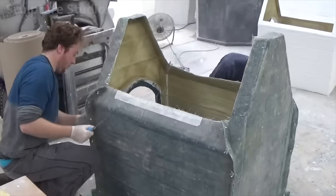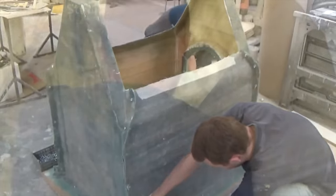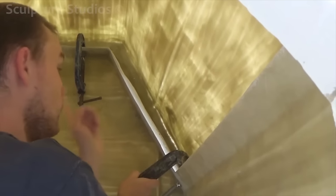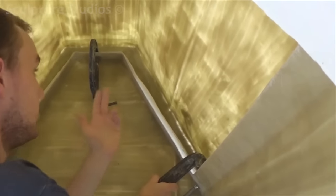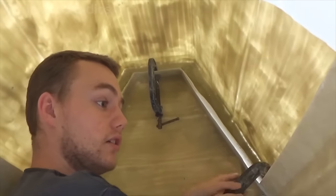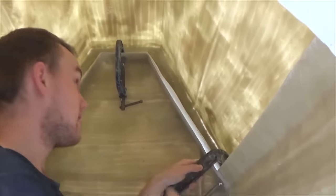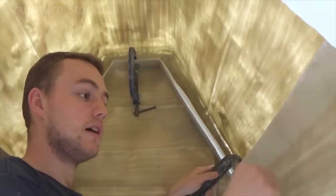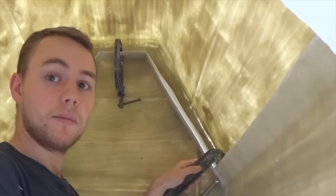When finished, the roofs are put on top of the base sections so they can be fixed together as one unit. Aiden is bolting together the base part and the roof — first matching them up so it's even on both sides, clamping down the tops and then the sides. He drills holes evenly spaced along the seam, puts bolts through and tightens them up systematically — doing one top side first, then the other, going along the sides once everything is matched up, ensuring all gaps are nice and tight, then removing the clamps and filling from the outside so it's all filled in.